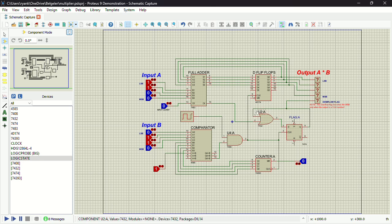Now let's move on to the flag. This part here is a combination of a D flip-flop and a latch. The purpose of this flag D flip-flop is to store the overflow flag. The overflow flag tells us whenever any computation exceeds four bits — it will be set to one whenever we have a result that is greater than four bits.